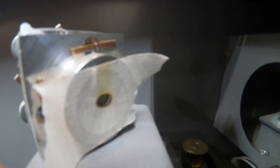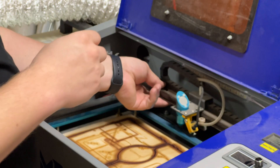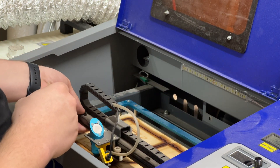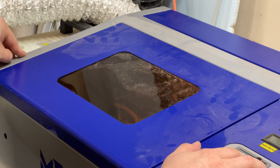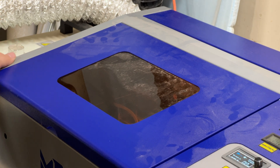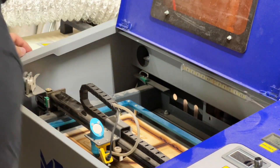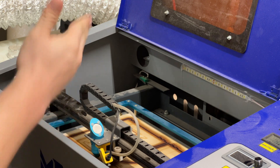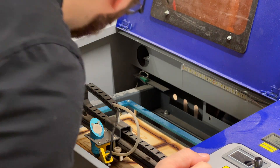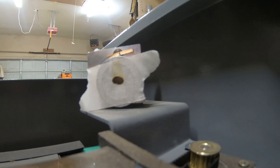As you can see, that's pretty dead center. Now we will check the front, so we're going to move it up to as far forward as we can. Turn it on, close it, and test. Turn it off. The reason I did not change the tape is because I wanted to see if it hit basically in the same spot — the easiest way to test that is to leave the tape on there. And we did hit very much in the same spot. There are not two dots on there, so we only have one, and that's really what we're wanting to see.